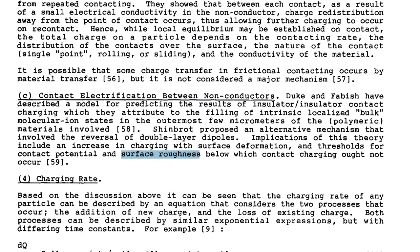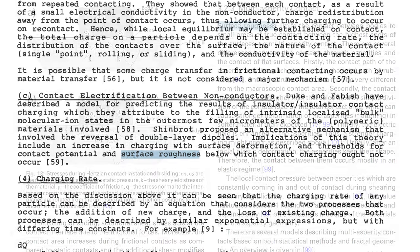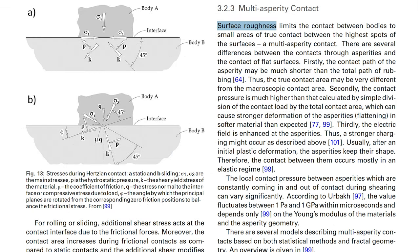Research is also inconclusive whether the surface roughness of the tube plays a significant role. I believe roughness does play a role, however marginal. A rough surface would catch particles and perhaps spin them to a certain degree and promote particle collision, which is broadly believed to be a major factor in charging particles. Surely there are limits to this — if the tubing is too rough, as in metal tubes, I can see how that would damage particles.